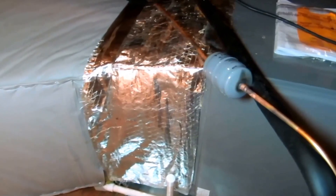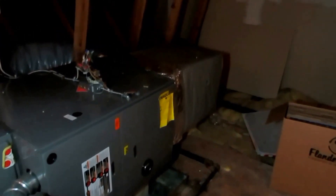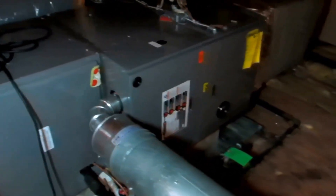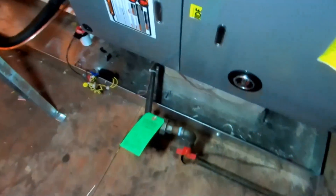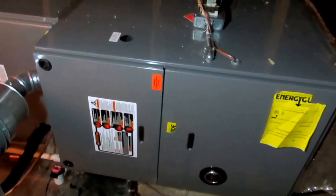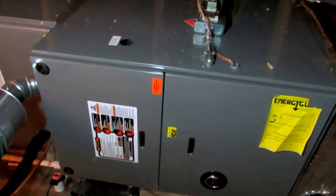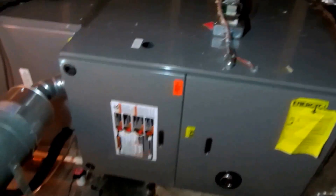My charged unit — the suction pressure was a little bit lower than I like, but that's because of the lack of return air. I'm going to give him a price on putting a 16-inch flex on this thing and it'll run a lot better with that. I've got to wait for the kids to go home at 5 to fire it up — because a lot of times when you run these units for the first time, they smoke the place up a little bit and the smoke alarms go off. In case the smoke alarms go off, it won't be an issue.